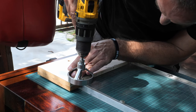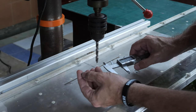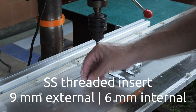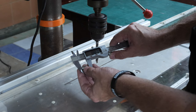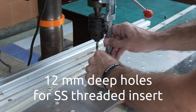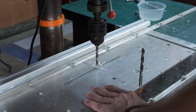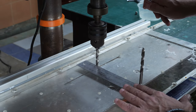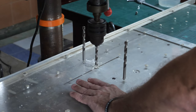I basically want to mark the holes for the drill press. I have the threaded insert which will go inside, and inside this threaded insert there will be a set screw or grab screw. Now I'm going to measure how deep the hole should be for this threaded insert — because we don't want to drill the hole all the way through. It should be 12 mm deep, and now we have 12.9 mm. Middle row done.